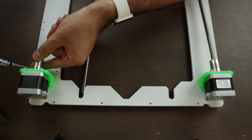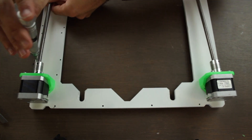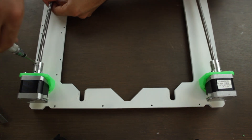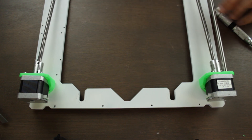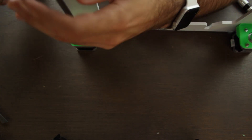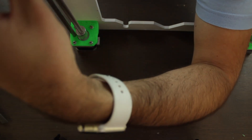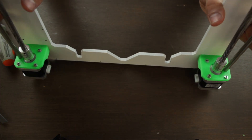As we have been doing along the whole video, we'll repeat the same process on the other side: first installing the flexible couplings on the stepper motor and then the T8 threaded rod. Finally, we'll need to install the 8mm smooth rods in the caps meant for it, next to the threaded rods as you can see on screen, getting everything assembled and ready to continue in the next episode.